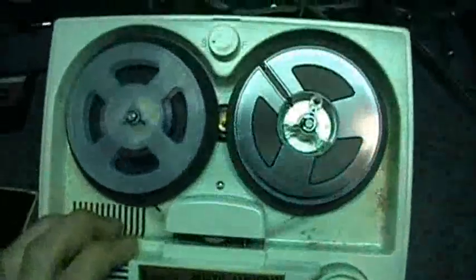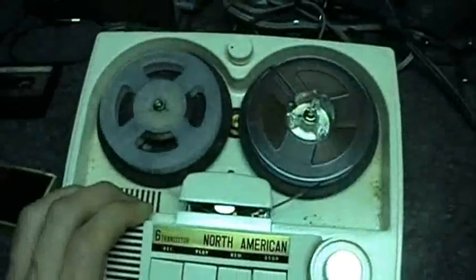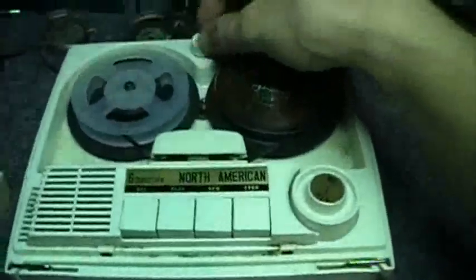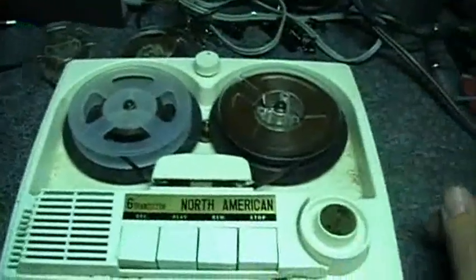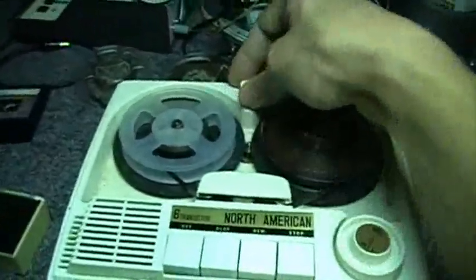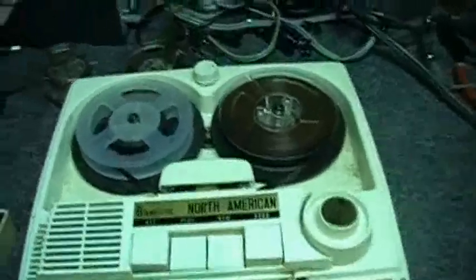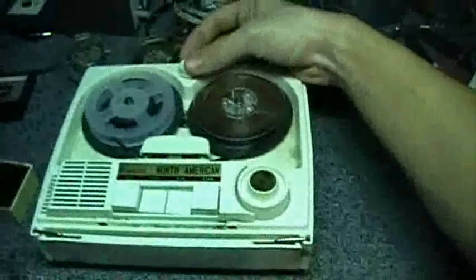Now, earlier, those weird sounds, I had recorded a toy, but anyway, what I need to show you in this video is that this reel-to-reel has an unexpected, unintended feature, which is that it will be able to play recordings in reverse. The speed control is basically reversed around two, and a lot more dynamic in how much it changes. You press play and rewind at the same time. It sets the machine to go in reverse. Now the reason why it's not turning is because the speed control is set all the way to fast. But I can adjust it.